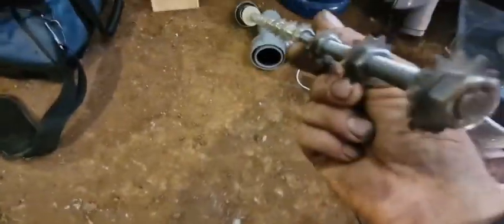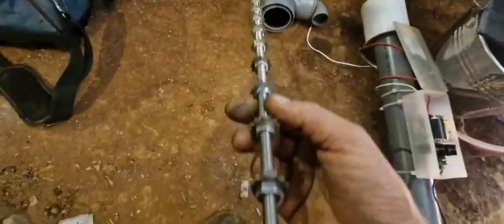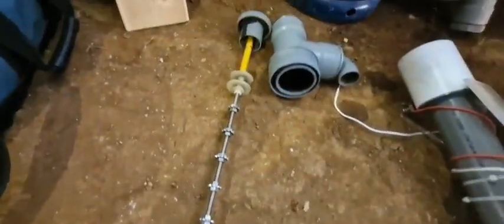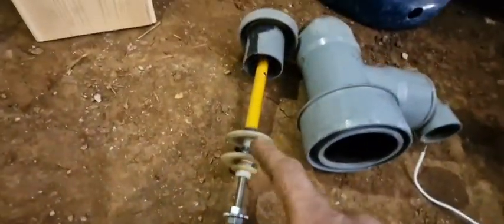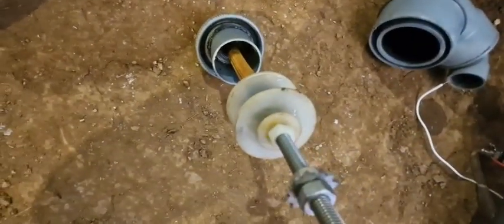This, however, is the primary electrode, the negative electrode. It's built from stainless steel thread with pointed washers every 5.5 centimeters, I believe, with some rings for isolation and kit and stuff, which is really necessary, I could tell you. Otherwise, the efficiency will drop quite quickly.